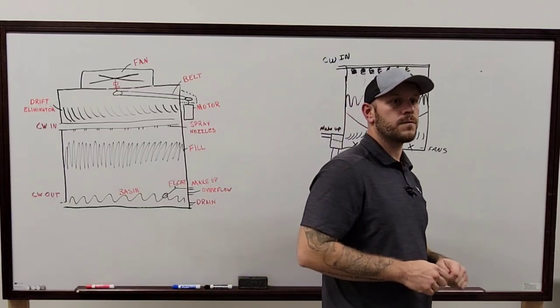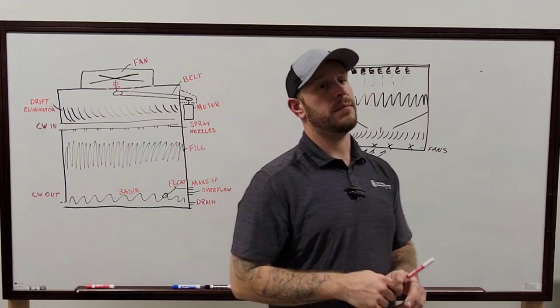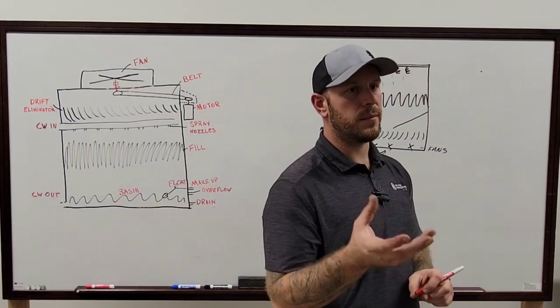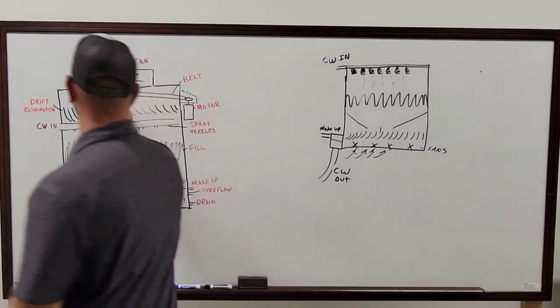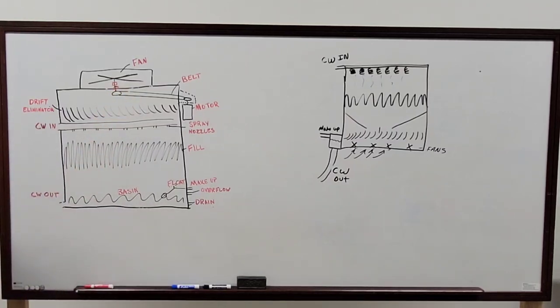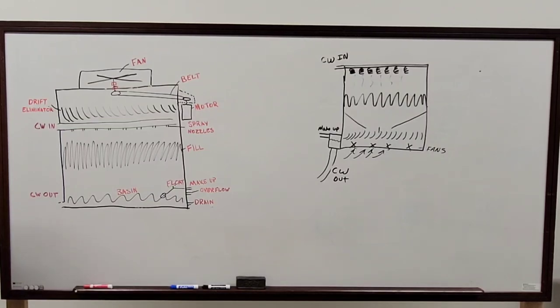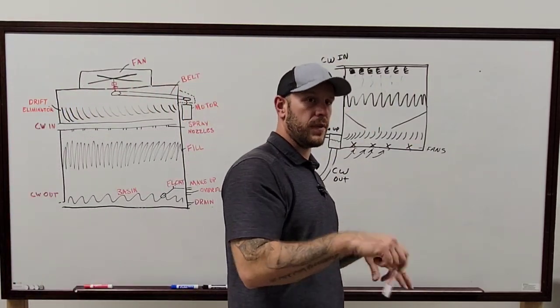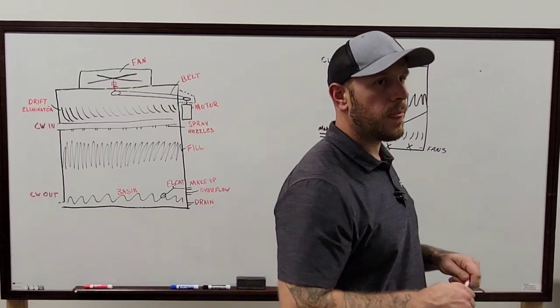So you're saying the rubber slingers? Yes, the rubber slingers. On the bottom. No, not the rubber slingers, those little plastic ones that they come with to do the locking on the bottom. On the pillow block bearing, it has a slinger. The rubber slinger that you're talking about for the grease trap always goes on top. Okay. That has to be on top, actually, I think. Maybe I'm calling it the wrong thing then. So the rain slinger goes on top. Right. The rain slinger prevents any of the water coming back into the top of that pillow block bearing. I'm trying to understand what you're referring to on the bottom.